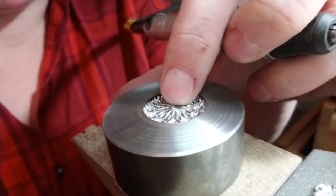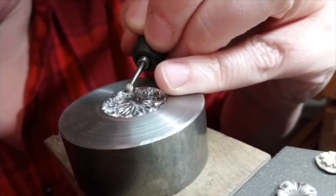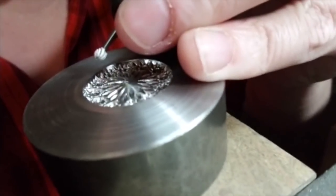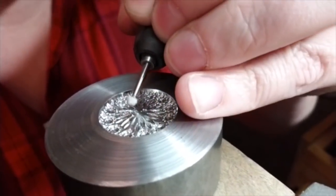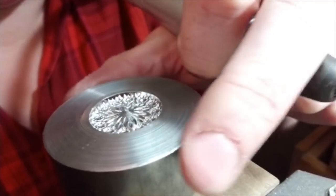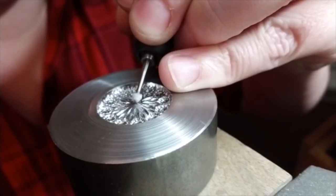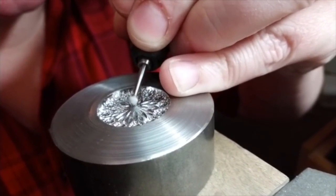That little reflective light right there — forgive the shaky camera, I'm trying to do this and film at the same time, which is a little crazy. I'm going to start my flex shaft, lubricate the burr, and then just go in very carefully and just touch that spot. Holding on to it with your other hand would be better, but I'm just slowly grinding away that little tiny dot — I'm not going too crazy, not trying to remove everything at once, just taking little nibbles.